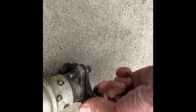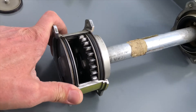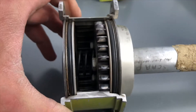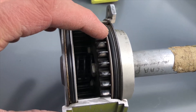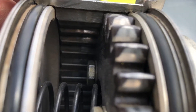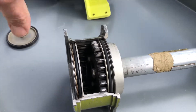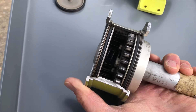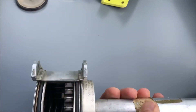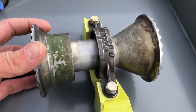This is another type of coupling for taking out misalignment. If you get the light right you can see there's a spring inside, and this spring is pushing the piece forward. The gears here mesh with gears on the inside. When there's a bit of misalignment or flex from the tail boom as things move, it can accommodate that. This is a Bell part — you can tell from the number it's a 204 part, so it's easy to tell which aircraft it came from.